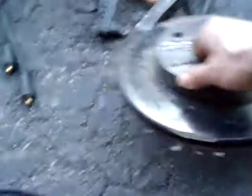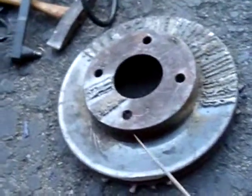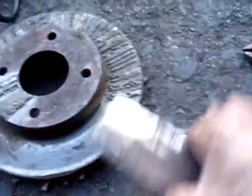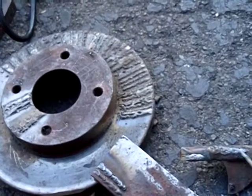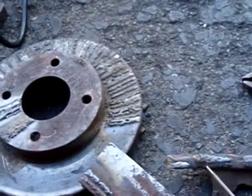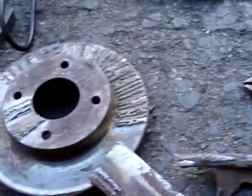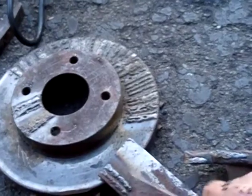This is where I was trying to grind to see if I could get the spark color. The sparks might have looked a little reddish or orangey on this one, and this might have been a little more yellowish — I don't know. I think you're going to tell soon enough: if you lay a bead and it looks kind of cratered — not from porosity, just bumpy — you're on cast iron. And if you're starting to get nice ripples, you're on steel.